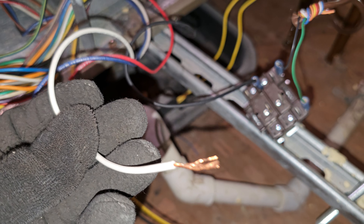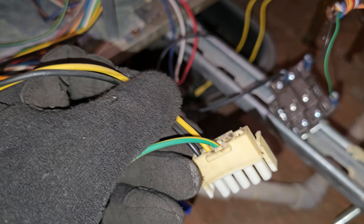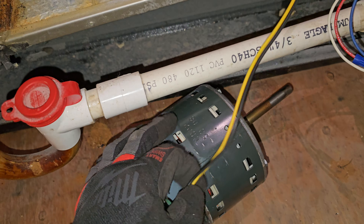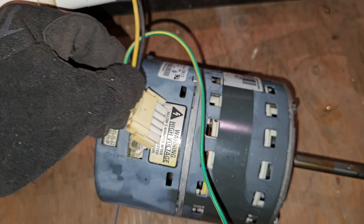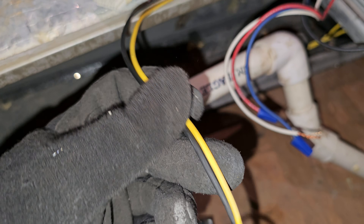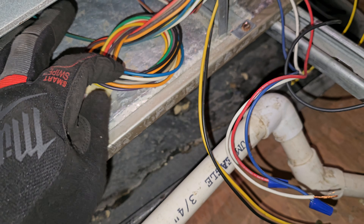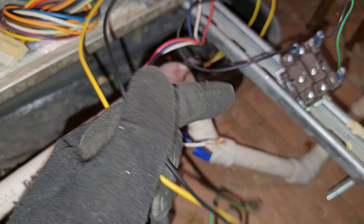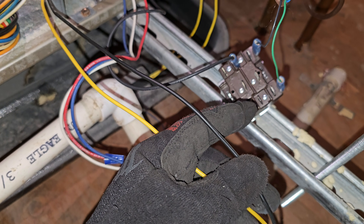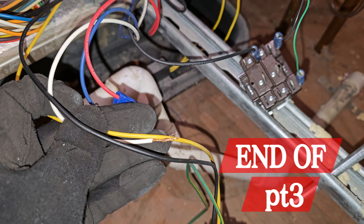Here's my common, or my neutral, or line two — whatever you want to call it — for my motor. This was the power connector for the ECM motor, right up here. I'm going to go ahead and cut these wires — it's just power. This part was for all the ECM stuff which I'm not using. I'll cap it off — later on if you want to put it back you can. I'm going to connect one of these wires to my relay, and the other wire to my line two or neutral for my motor.